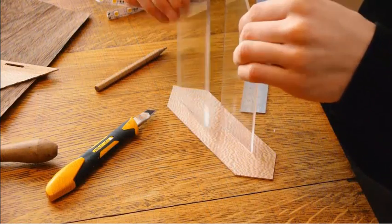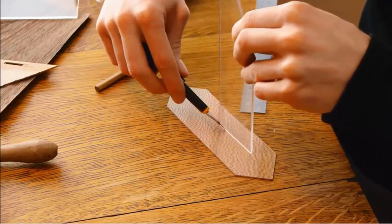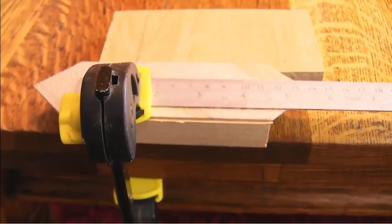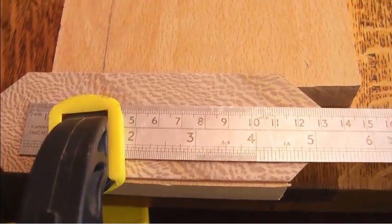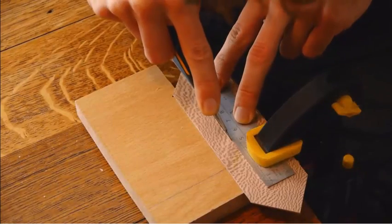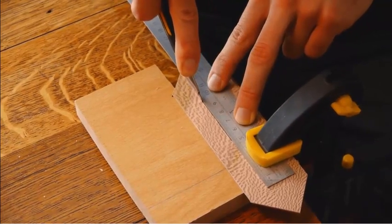Now position your plexiglass pieces on your hardwood shape and decide where you'd like them. Once you've decided, use a fine knife or a pencil to trace their positions. Now it's time to score along your traces using the fine knife. What you need to do is clamp a ruler down onto the hardwood shape, being careful to position the ruler's edge along one of the traces you made earlier. You may also want to put some scrap wood underneath so that you don't mark the surface underneath.